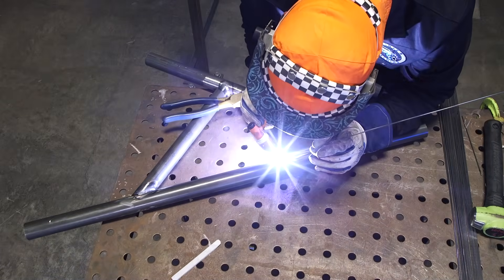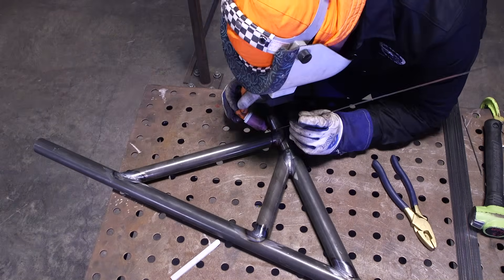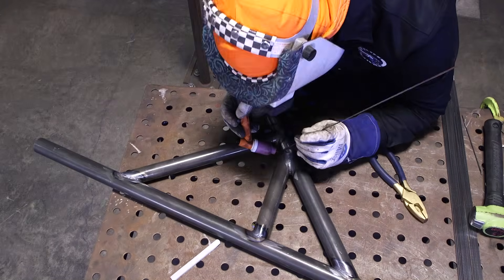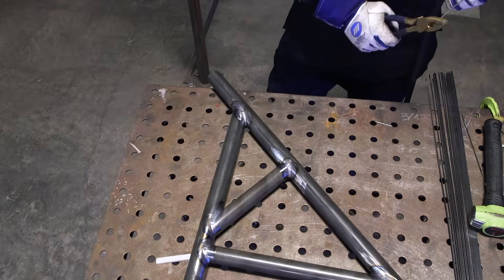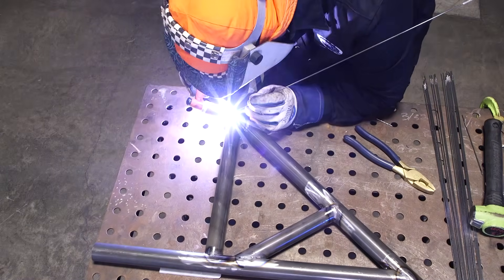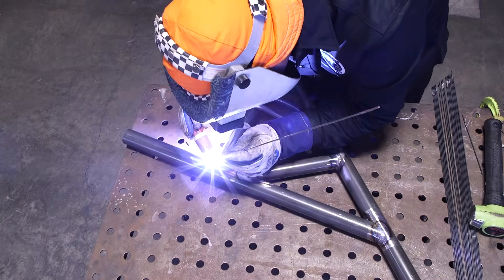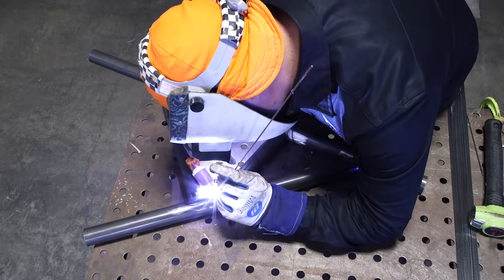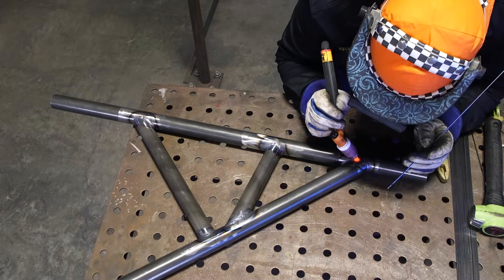With TIG welding, you're going for precision, not speed. If you have a good tubing notcher, your fit ups are usually going to be pretty good, but nothing's perfect — sometimes you'll have a small gap. Just add a little more filler wire and lower your amperage with your foot. Don't overheat it. I'm running the pre-flow a little bit long so that in tight places the argon purges it out before the arc starts. If your machine doesn't have adjustable pre-flow or post-flow, just open the valve a little bit before. You always want to run uphill with TIG, though sometimes you may have to run downhill — installing pieces in cars, motorcycles, suspension components — and that's perfectly fine. Just follow the same principles: nice and easy, nice and clean weld, and you'll have a nice and strong structure.